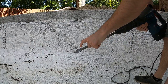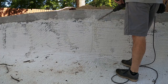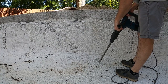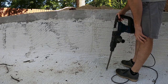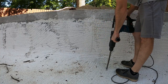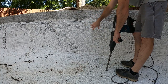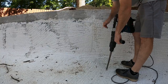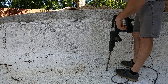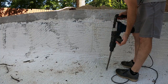First step: we're going to use this demo hammer with the chisel tip on it. My goal is to come out from the crack and chip off the rest of the existing plaster that the hydro blasting didn't remove from this section. We're going to work our way down and get down to more of a gunite exposure, so that as we're applying our staples and hydraulic cement, we're doing it on the actual gunite instead of on the existing plaster. I'm going to put on some goggles, throw on some gloves, and just start chipping into this. Hopefully it goes pretty quick.